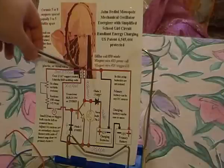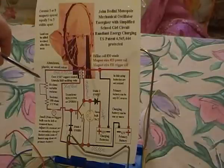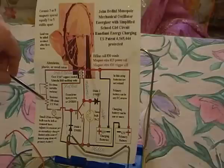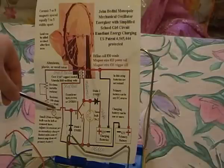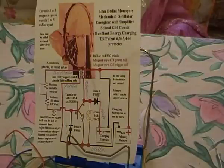I'm going to show you how I build my circuit. First of all steps: I started from this connection. Here is the cable which is connected to the 26 trigger coil at the top. Then this cable is connected to my variable resistor 1k ohm, then to the normal resistor 100 ohm, and then to the bulb — small bulb 25mA. And now I show this connection on my circuit.